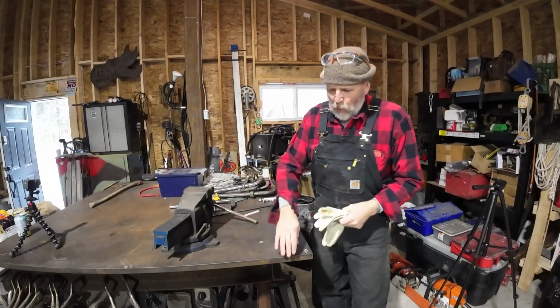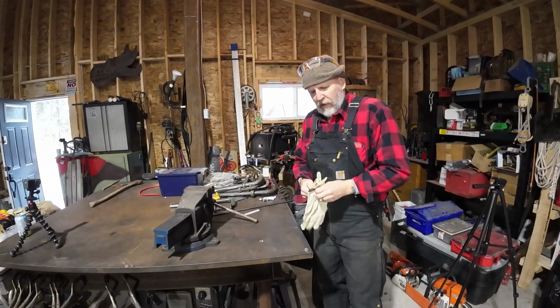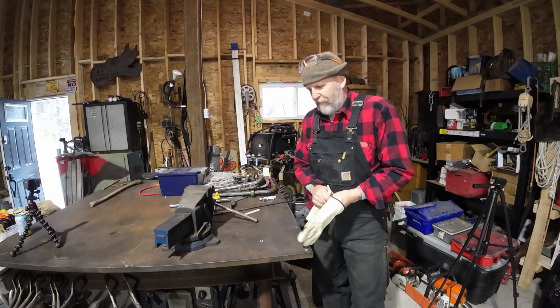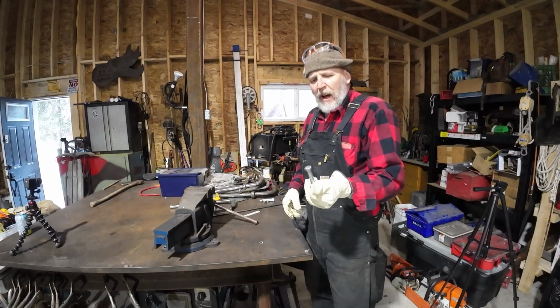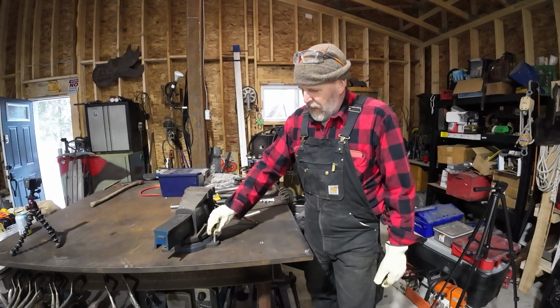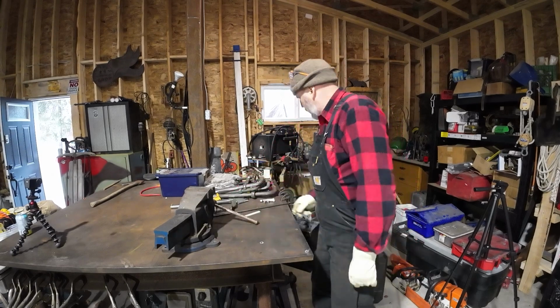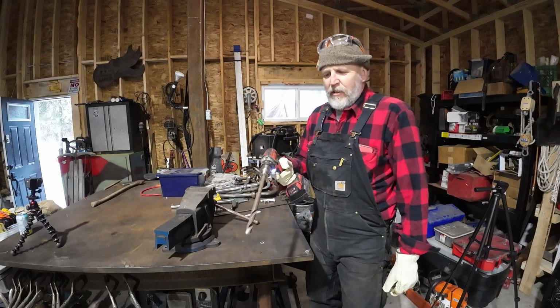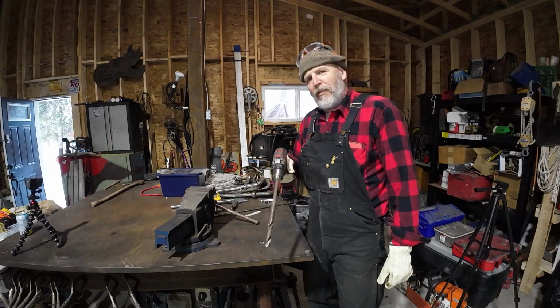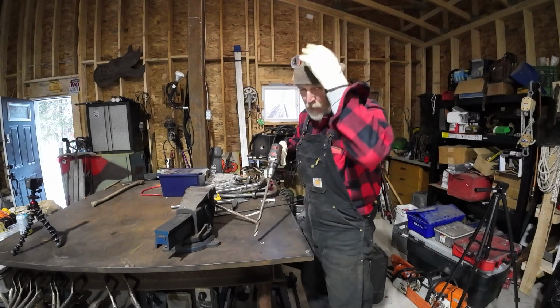So this is a full 1-inch plate steel. So I better go get the drill and get ready to drill this. We need to drill 1/2-inch holes. That's the bolts we got for there that will fit in nice. So I got this here. That should be good enough. It's a little bit off. It should be okay. Always wear your safety glasses.